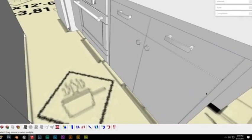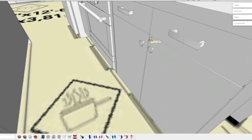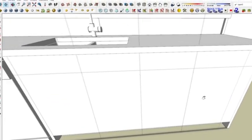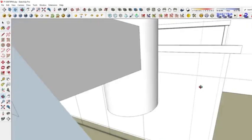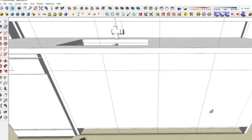So we'll actually try and just copy these doors exactly, and we'll utilize this space we have left over at the end. So it's 1'4" and 1/16. The space that we have left over is 4.5 inches. And so maybe what we'll do instead there is if we were to make this, say, 5 inches, I think we could probably utilize that space a bit better. So we'll say 5 inches on that end.